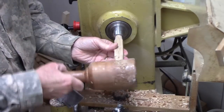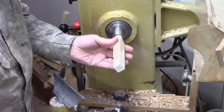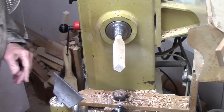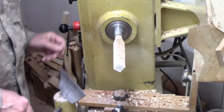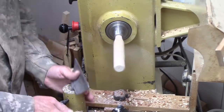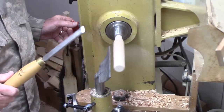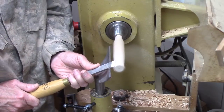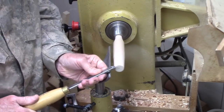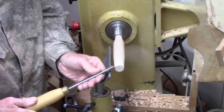This is a really old school way to do it. Works better with large lathes with strong bearings. Many lathes you need to be careful that you don't damage the bearings, but this is a very strong hold. Let me show you. You might have to tap it back every now and then if it works loose. It does generally do better if you cut the cord in there when it's coming loose. Just tap it back in.